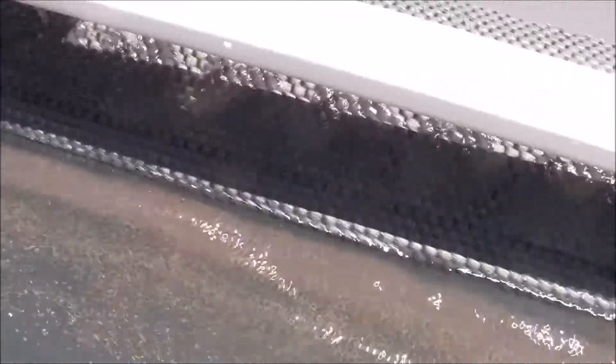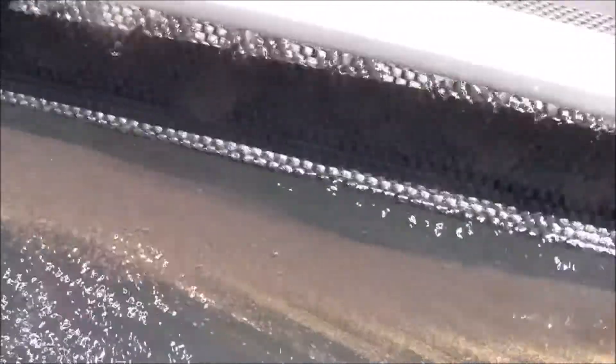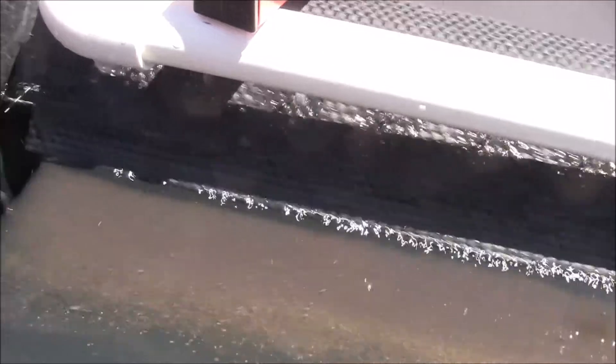The gold that is in this black sand ranges anywhere from the size of a couple of small pickers to 100 to 200 mesh, and with the glare from the water you can't see it traveling along in a very thin line at the very top of the line of black sand. Now I am going to intentionally lower the front end of the table and you can see how the line of black sand moves toward the middling compartment as opposed to the higher-grade compartment.